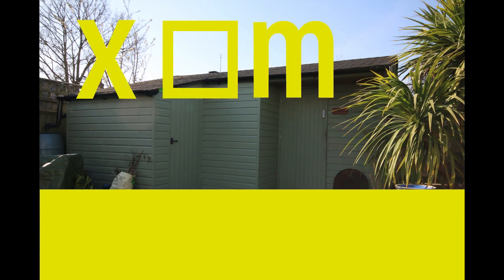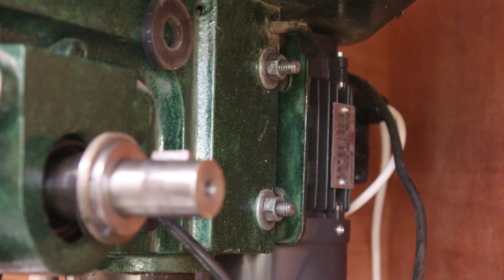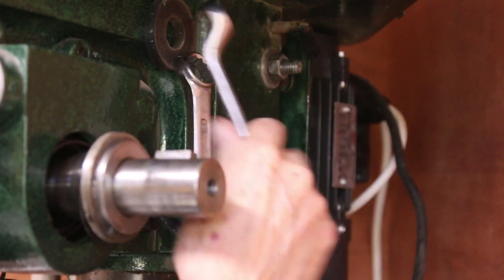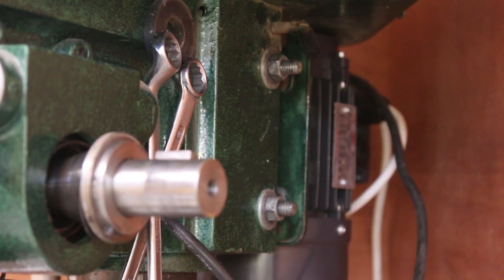But there's one more thing left to do. The steady will hold it in place for small work such as drilling and light milling, but for anything else you still need to clamp that head to make sure it stays nice and solid. You still need to tighten the two bolts in the back to keep the head solid. I keep a couple of ring spanners attached on magnets to do this, but it's still quite tedious. You can't leave them on — they rattle loose.